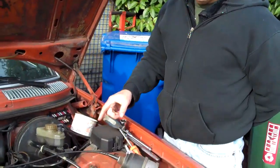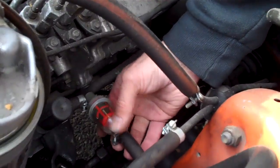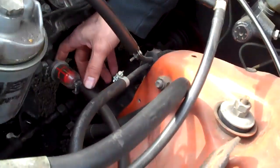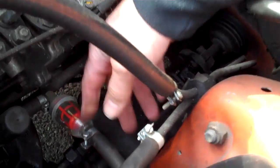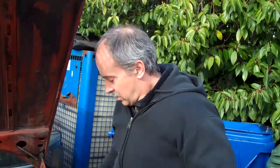The Mercedes stuff was just good quality. This has a primary fuel filter and a secondary fuel filter. The primary is this little strainer down here, and people just look at that and think, 'oh, that's the fuel filter, it looks just fine.' No — it's just the coarse one, and this is the fine one. This one happens to have a lot of garbage in it. We'll pull it out so you can see it in a minute. This car doesn't really have many symptoms — it smokes a little bit when it gets warm — but the filter is obviously blocked, and that's hard on the unit. So we're gonna change those.